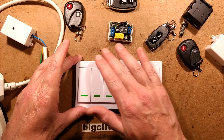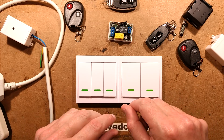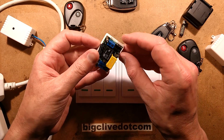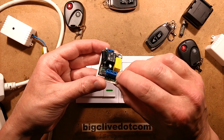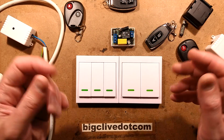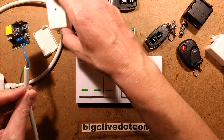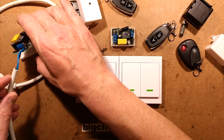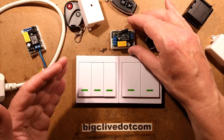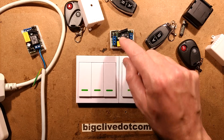I've seen DIY shops in the UK selling little modules that are very similar, and I get the feeling that there are just bunches of this stuff poked through holes in the plasterboard of the ceiling by hobbyists, with bare wires everywhere. That gets a bit worse when you realise that to programme these you've got to actually open up and press this button - preferably not with your actual finger - because all the circuitry in this is live at mains voltage when it's powered. And it has to be powered to programme it. If you've got it out to programme, it's just going to flop out of the circuit board. So maybe something better done in a controlled environment rather than standing on a ladder poking about. I certainly wouldn't rate these for professional installation - they're fun for hobby purposes really, especially with the rather shady relay rating in there.